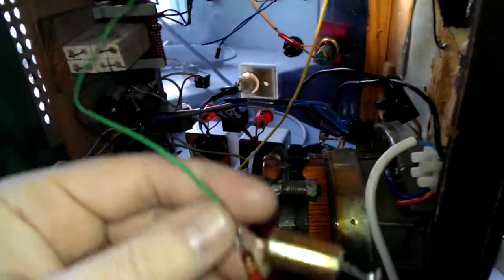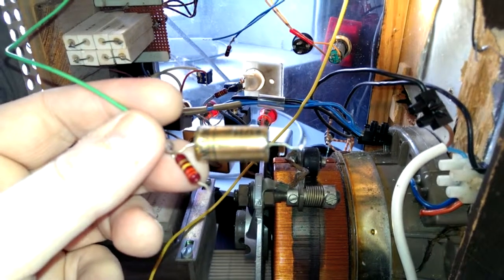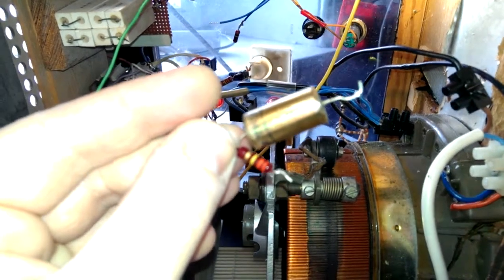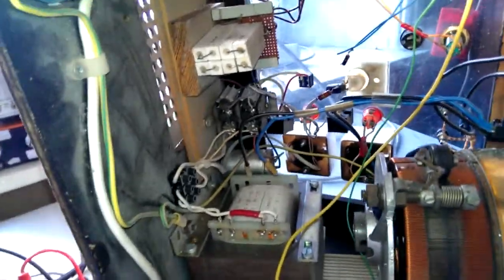So yesterday I already prepared a couple of things. Basically the tube socket here with attached resistors already. This one is plate 1 and this one is plate 2. They will actually go to a switch. Then we have the green, the common grid, and just for test purposes I hooked up this capacitor so that I can feed some signal generator on it, and this one was meant for the resistor here. This 220 kilo ohms was meant to connect either to the ground or to the cathode of the tube.